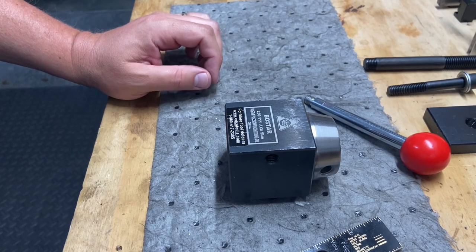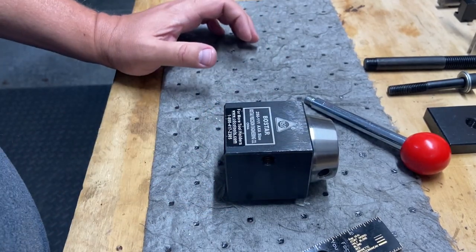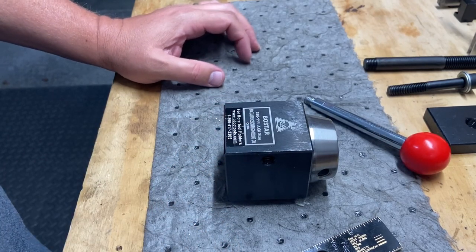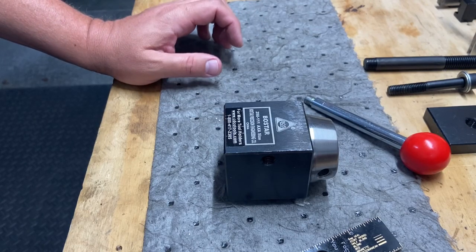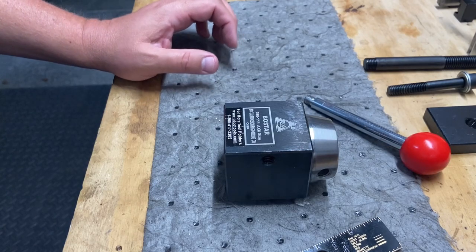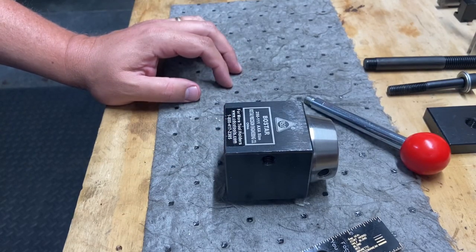Things you wanna take into consideration are lathe center height. There's charts out there that tell you how to pick the right size, and this is in between. You can go with an OXA or an AXA for these small mini lathes. I decided bigger might be better in order to be more substantial for the issues I was running into, and I wanted to go with steel. So this is what I got.